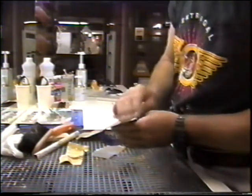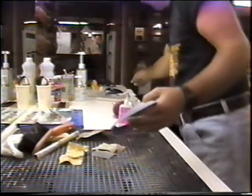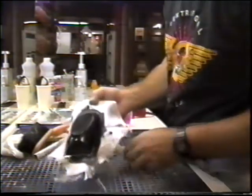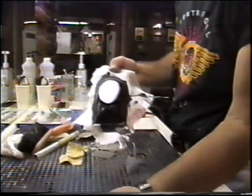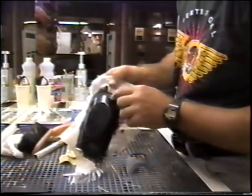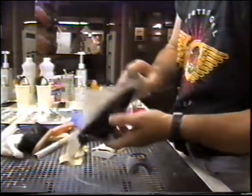So what I'll do is my black cowl, now I pulled this one out of the mold before. This one has an air pocket in it too, so I'll do the same thing. As I lay up the next cowl, I'll use the leftover resin to patch this, and of course tomorrow then I can work on this one.